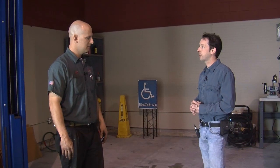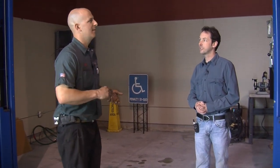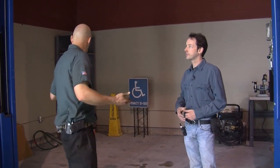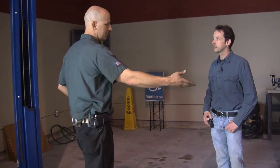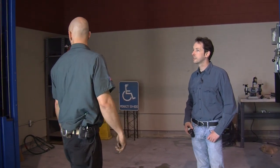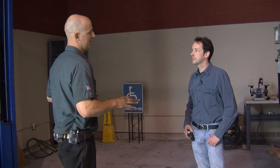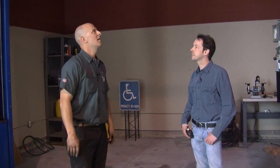What are the proper things people should know as new owners of a beautiful new rotary lift? With a Rotary, not much — there are no lubrication points. The equalizer cables: it's good to know that if you're lifting vehicles and you notice one side is off from the other — maybe the passenger side is ahead — you can hear the locks actually clicking in. You can set the lift on the locks without any weight on it to adjust it. You don't ever want to adjust it loaded because vehicles change from one to the next. Adjusting on the first lock without a car on it is usually the best way, and then test it.